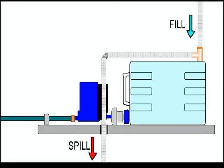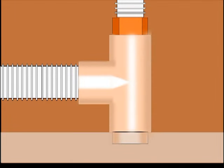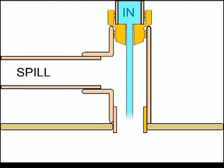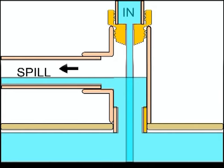To prevent the plastic tank from overflowing overnight, I made a special valve which diverts the water to an empty container. The operation of the valve is very simple and has no moving parts, except for the water itself. The water entering from the air conditioning does not hit the walls of the other fittings, but falls straight into the plastic tank. As the plastic tank fills up, water rises through the pipes and reaches the spill container.